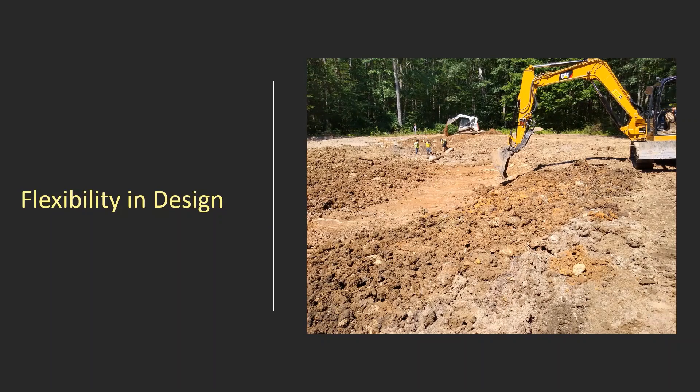Another change in plan: our original design would allow water to seep over the edges of the pool berm and fan out into the wet meadow, but we had concerns about channeling in the meadow. So we created a general outflow that would snake and run across the area before feeding into the wetland. Everything looks good on paper, but once you're on site under construction, sometimes you need to make changes or figure out a better way. In this case, we were finding a lot of salamanders in the spring channel, and this design mimicked that channel, which we hoped would actually add additional habitat for those salamanders.